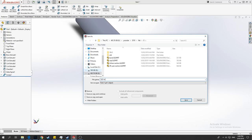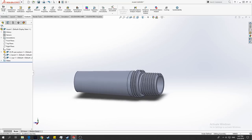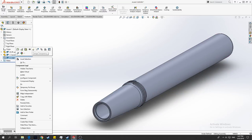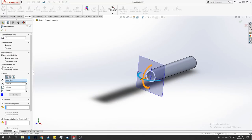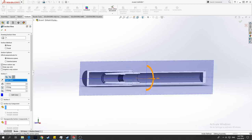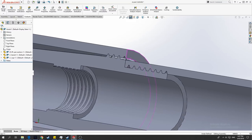Once I finished modelling the section, I went ahead and did the same for the cap and the barrel. And to anyone who was asking how I knew how thick to make the plastic, honestly, it is just a good guess. The data on SLA resin is very brief and it's not well covered, and the strengths of this resin range from 20 megapascals to 60. So honestly, the thicknesses are just a guess. But until I get some proper numbers, I'll just be guessing it. And anything that breaks, I know I'll have to make thicker.